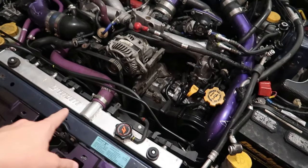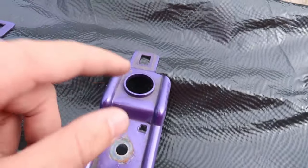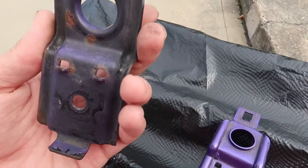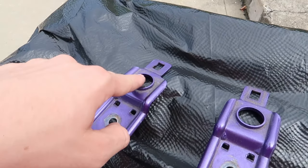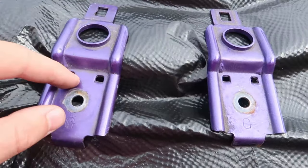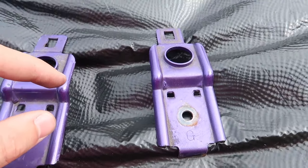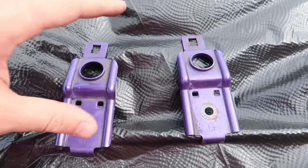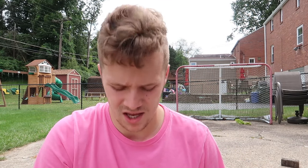The first thing I want to do is clean these brackets — they are super duper dirty. I'm going to clean them down and then hit them with sandpaper and rough up the surface so I can prime them and it'll have something to adhere to. I'm going to start with 80 grit just to scuff it up and take off any loose paint, and then if most of it comes off I'll move to 180 to smooth it out a little.